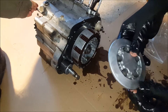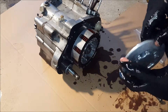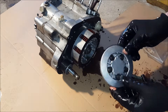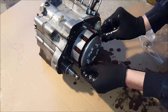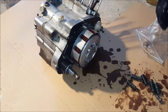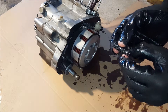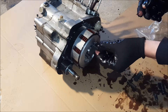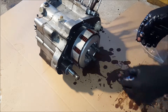The next thing is to take this front clutch plate. You don't have to line it up with anything — it just goes on. There are no markings on this one, but if there's a marking you'd have to line it up with the arrow. Just put it on however it lines up right. Now we've got the springs with screws — we've got five of them — and each one goes in there. Start them off with a screwdriver first, then you can drill them the rest of the way.